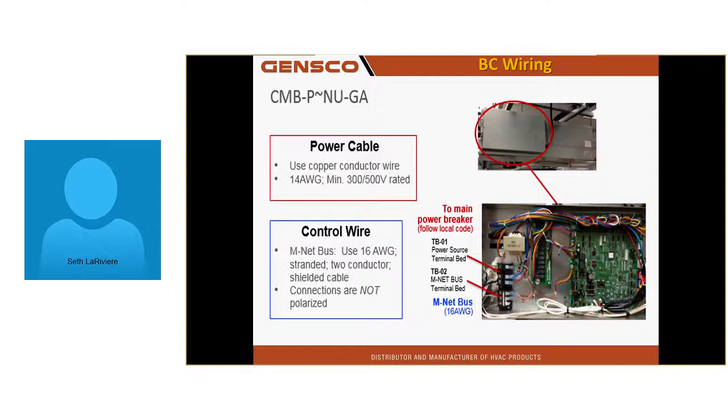I say that because I went on a job 6 months ago. It was a house with a PURY, 8 indoor units. 4 of them, after 2 years, the fans quit running. And when we got there, we found the electrician had wired it with 110 volts instead of 220. We couldn't easily fix it by just putting in a double pole breaker because he also hit wall outputs as he went down the line. The electrician was out of business.